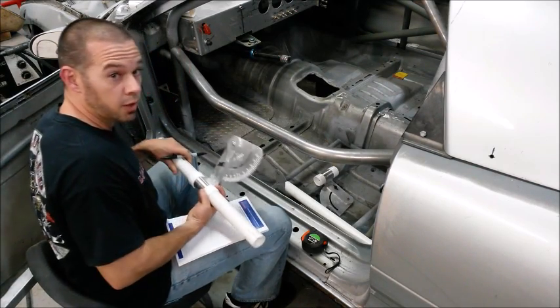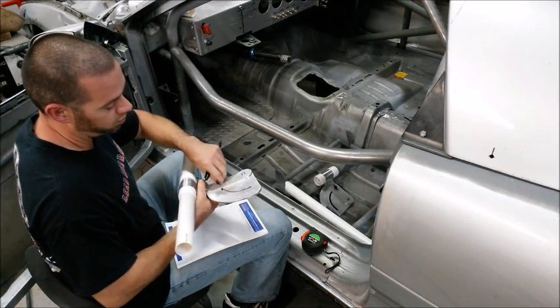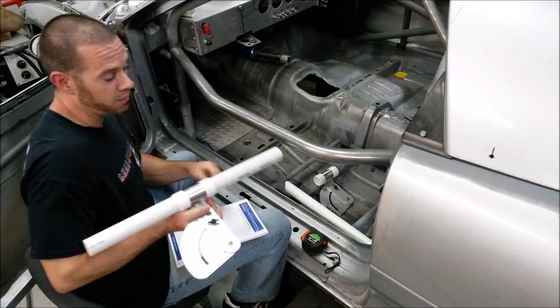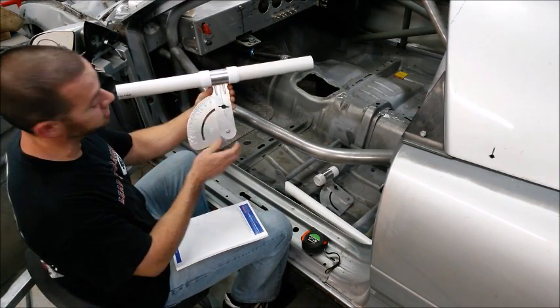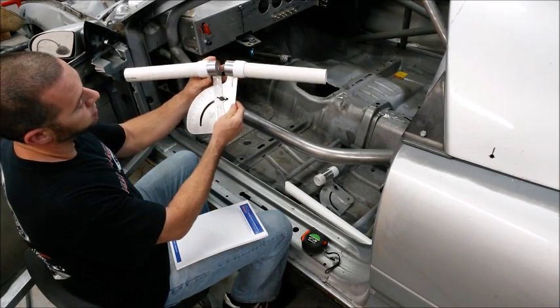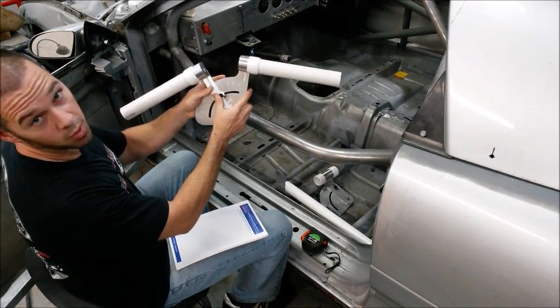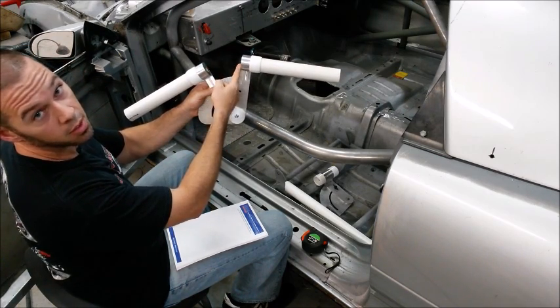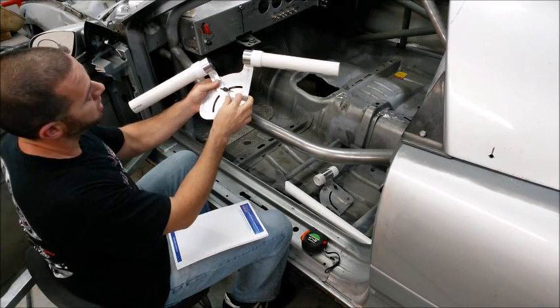So here's one Cage Gage. As you'll hear me refer to the tangents of the bends, well, obviously now there's no bend. This is just straight, 0 degrees. As you start making a bend, the tangent point will be where the bend starts and stops, which is your inside points here. These blocks are 1 inch thick, just for reference.